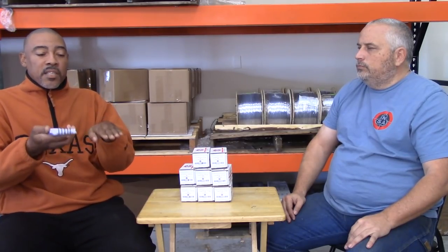Okay. And I can definitely testify to that, being a long-time cast bullet person. I do it as a hobby, as most of you guys know. When he got into swaging, we were having discussions as to which was more consistent and which was better. And when he started making the ammo, I was measuring your ammo, and I was getting like a tenth of a grain variance. With my cast bullets, it was like 2 grains. With pellets, I see 2 grains difference from one pellet to the next. So as far as consistency, I can testify there. I haven't seen anything more consistent than that.